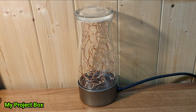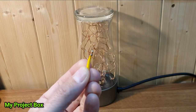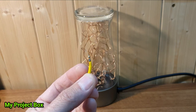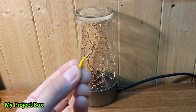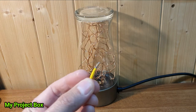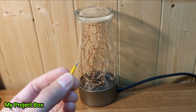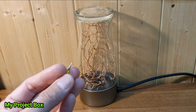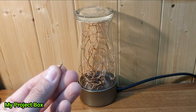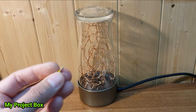I had a problem with that little sense resistor. I think the value was too large. Strictly speaking, it wasn't necessary. I added it as a safety feature. It worked before the lamp was put together, but for some reason, some capacitive effects, maybe interference from the power supply, this resistor would interfere, and the signal isn't strong enough from your finger.